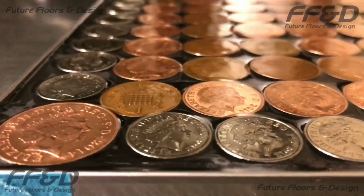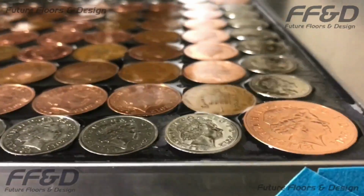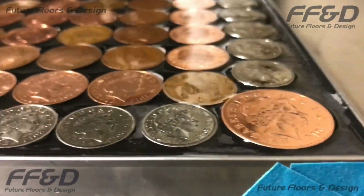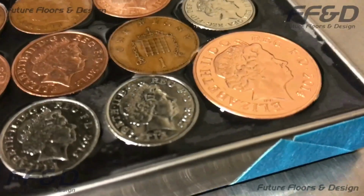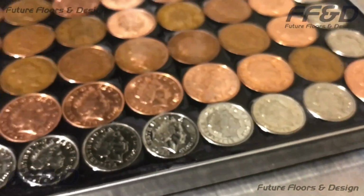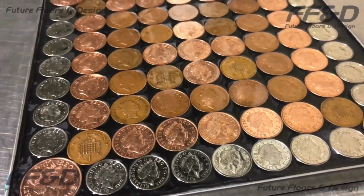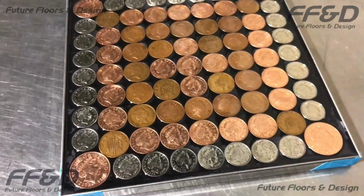The first coat has now been left to cure for 24 hours. This is the recommended time to allow the resin to cure before walking onto its surface. As you can see, the resin has sunk into the grout in a few places over the whole area. This is why we apply the sealer in multiple small coats as opposed to one flood coat.